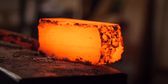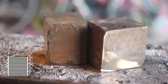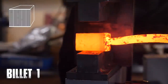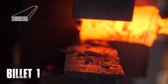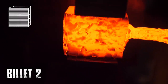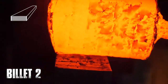When that's done, it's time to cut it into our two separate billets, which we'll manipulate to make their lines run perpendicular to each other. On billet number one, we're just turning it on its side and drawing it out so the layers or lines will run vertical along the length of the flat bar. Billet number two is drawn out in a more typical orientation such that the parallel layers run along the flattened axis, much like you'd normally expect in a piece of pattern-welded Damascus.